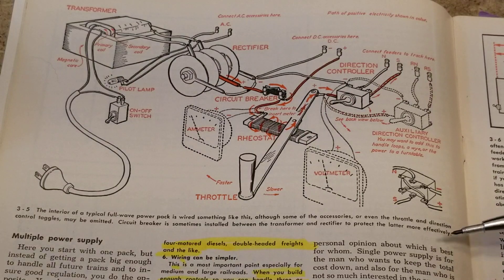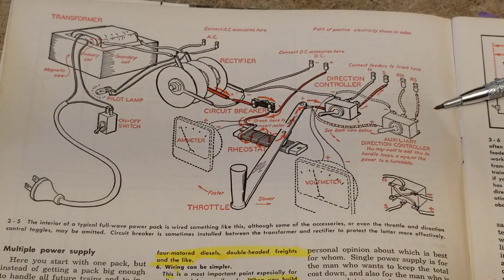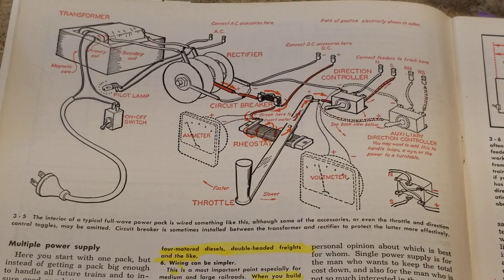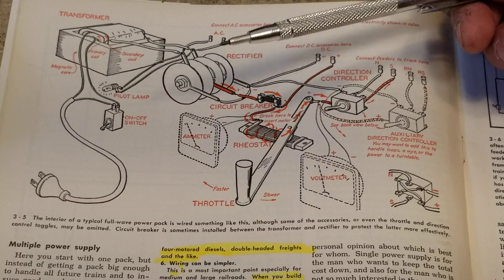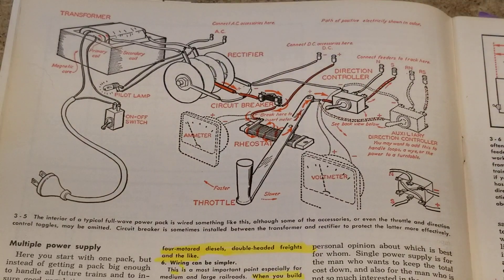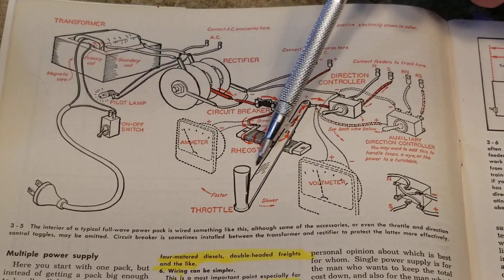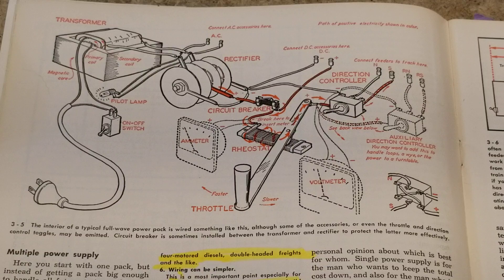For this one, I'm thinking of adding a computer fan to the box. On momentum power packs like the auto pulse, a fan would have saved a ton of problems — a lot of those overheated because the momentum circuitry overheated and ruined things. Anyway, using some bridge rectifiers we should be able to add indicator lights, add a new longer power cord, and then make some cords with alligator clips. That's the plan to make this a nice portable tester and a good power supply.